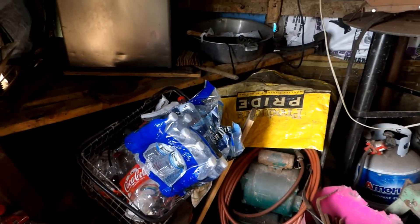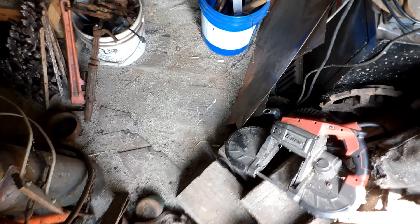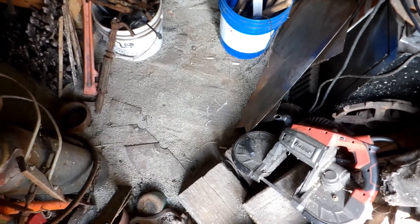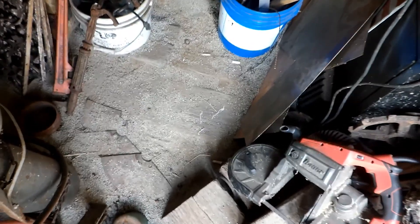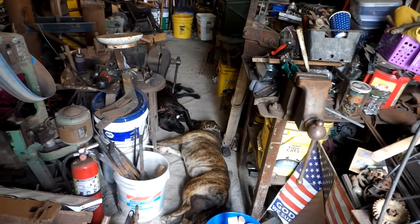I do go through a lot of water. When we decided to take this out of rabbit production and turn it into a blacksmith shop, one of the issues was it was wintertime — it came a hard freezing rain, then it thawed, then it rained for like three days straight, and there was about a foot of mud in here — everything was sinking and disappearing. So I laid cross ties — like railroad cross ties — in here with about a half inch to three-quarter inch gap between each one. Then I hauled 1.7 ton of sand in my pickup truck and had to wheelbarrow it all out here. It makes for a really nice floor — it's easy on your back. The whole floor is nothing more than sand and cross ties.